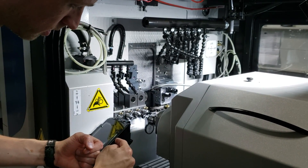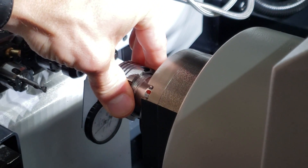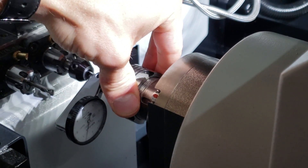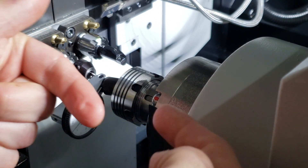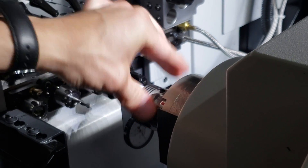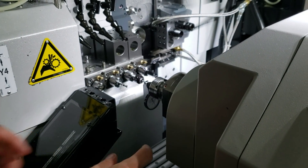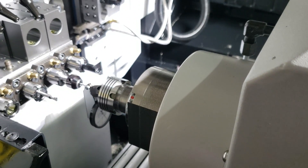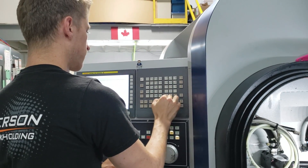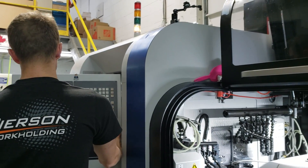So I'm checking for alignment — I want the tool and the spindle to be perfectly lined up, not out in Y, not out in X. As I rotate the sub spindle I should have a couple thou preload, and already I can tell I'm out a little bit just barely rotating it. I move it into position so that while it rotates, the dial basically shouldn't move. You have to wrap your head around it and figure out which way to move — up, down, forward, back. I'm confirming that my position in the machine is accurate, which it's not right now, so I'm going to call the tool offset for T520 again, two-handed mode, run the cycle.